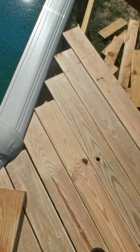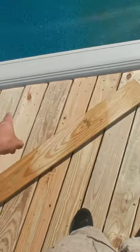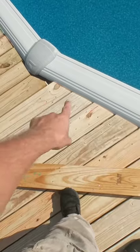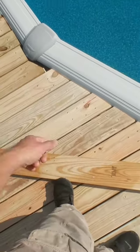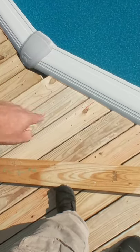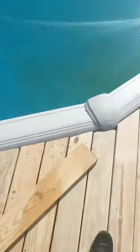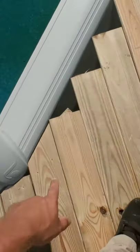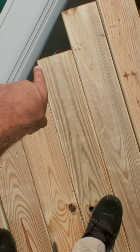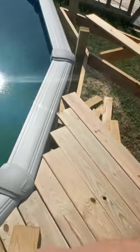When you're trying to get this angle, there are a couple of different ways. You can find the angle and start scribing each one, or you can go up under the deck, run your board a little over the top of the side of the pool, and scribe the bottom right there, then get down and cut it. Or you can do it this simpler way I'm about to show you — take your boards and run each one all the way to the edge of the deck.